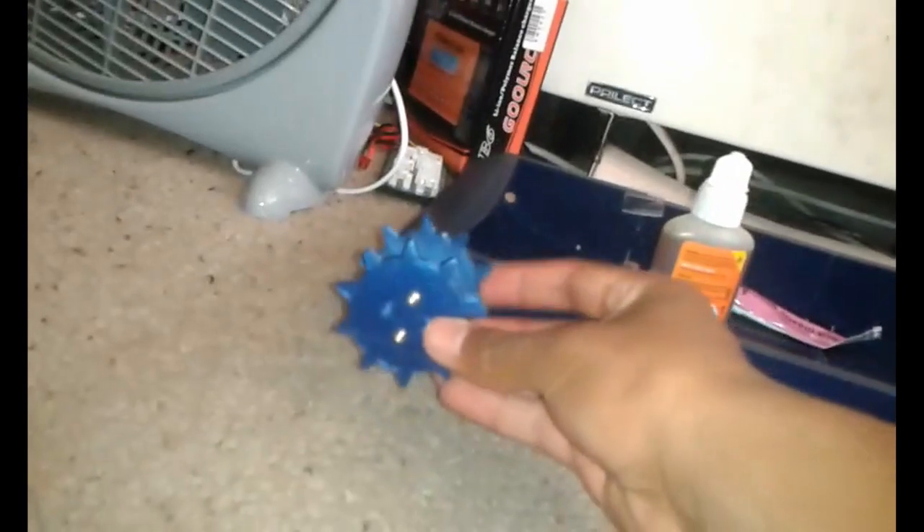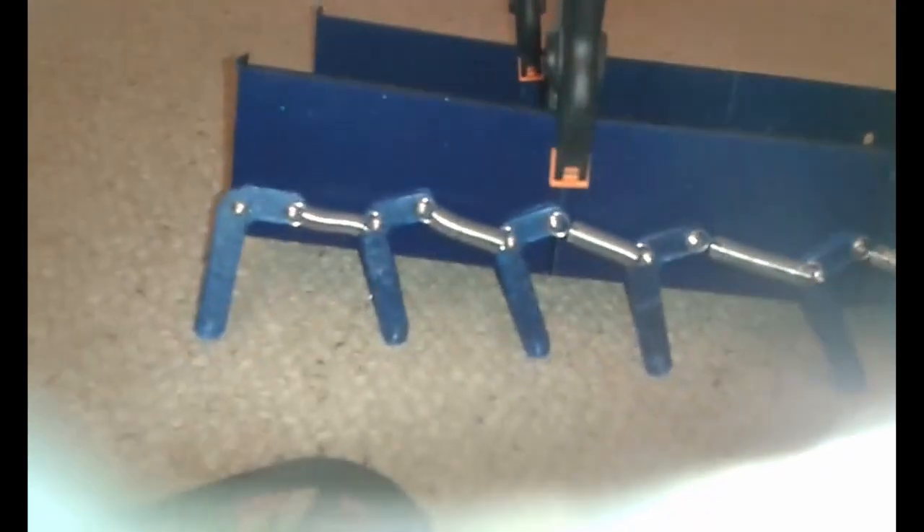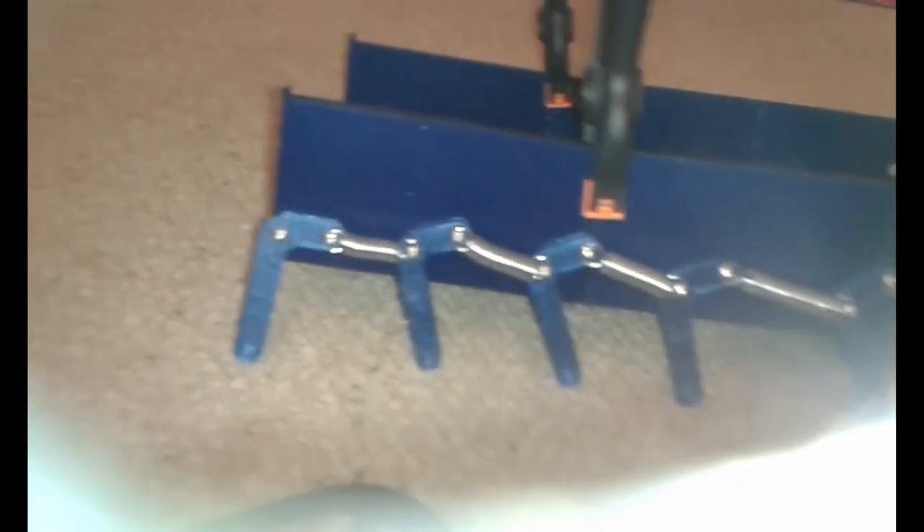That's the hull. I haven't got all the suspension arms on yet but this wheel will go here, so that will go like about there. It's going to be in four pieces. There's a little bit of warpage between the parts, but the part is actually bigger than the print bed — it's 20cm whereas the print bed is 19, so I had to put it at a 45 degree angle so it just fits, but bits of it actually go off the edge of the print area.